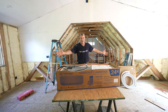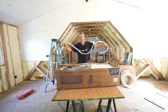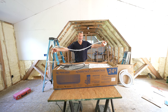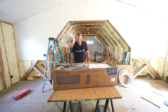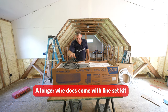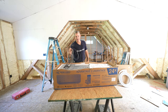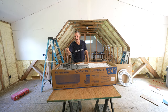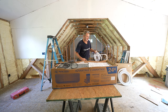Make sure you're buying equipment that fits for wherever you're going to locate this and how much room you need to reach the condenser. The condensate hose it comes with is only about six feet, so I had to purchase a longer condensate line. Also, the wire it comes with to connect to the condensing unit is only 16 feet. So we're going to junction that using some three-wire, 14-gauge wire, and then use the original outdoor-rated wire to the condenser unit. Otherwise you'd need exterior-graded Romex, which can get expensive.